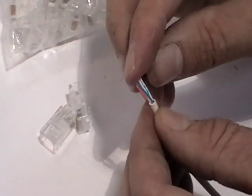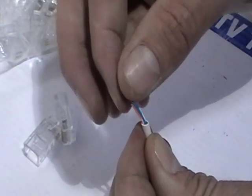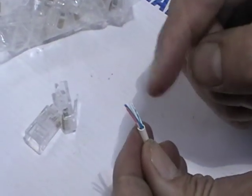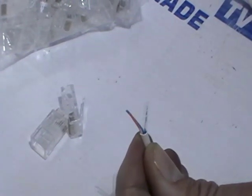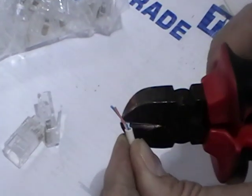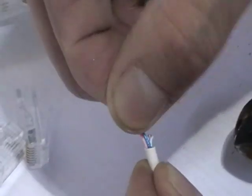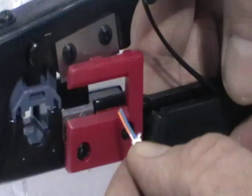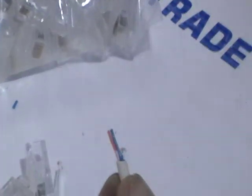As I said previously, only two of these cables are needed. On this particular cable we have orange, blue, blue-white, and orange-white. I'd normally just use the orange and the blue cables. I simply bend over the other two or snip them off. Then I line these up to make sure they're nice and straight. If we're not happy with the length or they're not straight, we put them into the cutting mechanism and snip off the top.